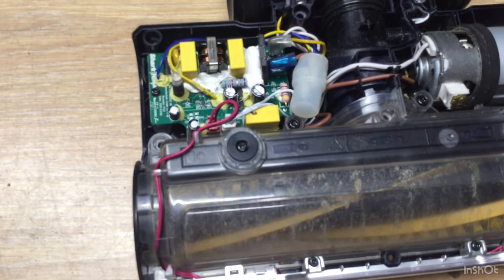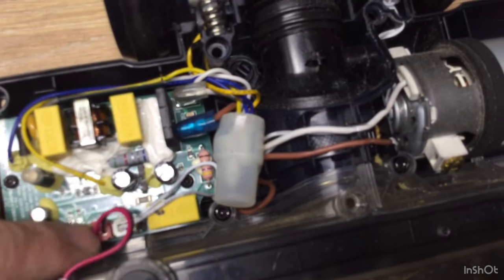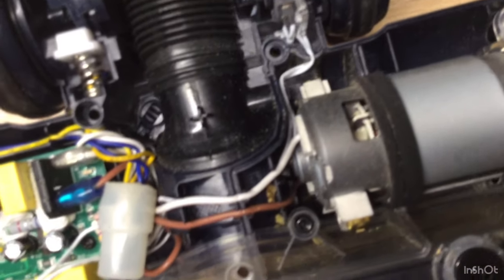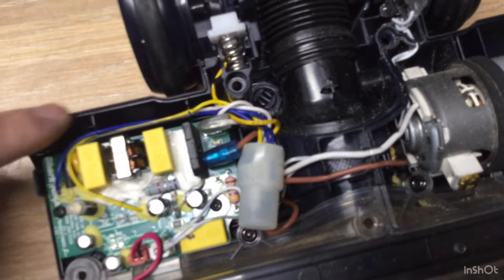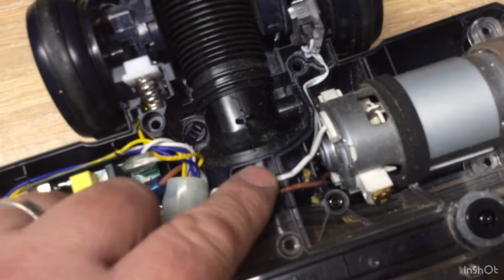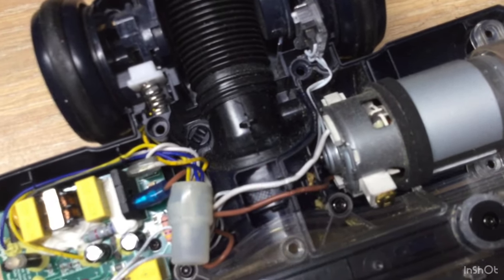That's your upright switch — it goes up under there. You can see how the wire goes through that slot, goes round, and truly goes under. They go to the back. It's something you don't realize you need to know — you take everything apart and then you're like, how did that wire sit? Basically all you're doing is making sure everything comes below all the fixing points, so wires go below and through that gap so the top cover just sits on there.